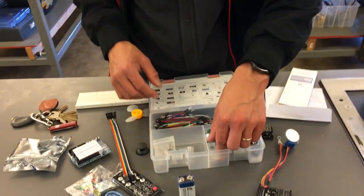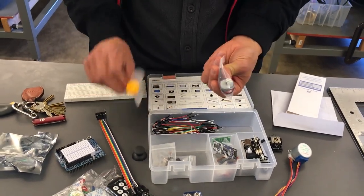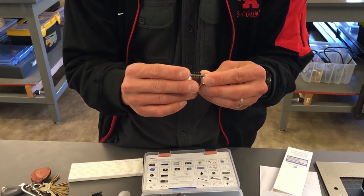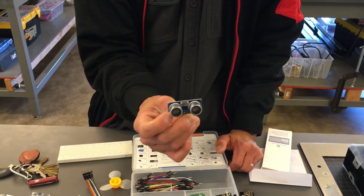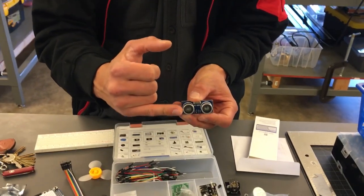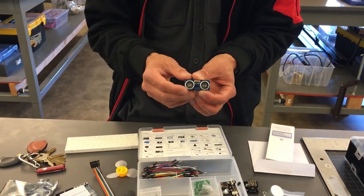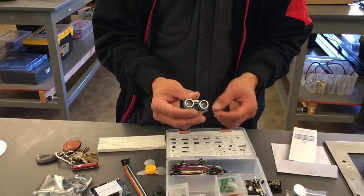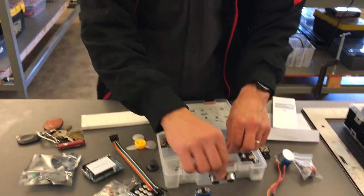A standard DC motor — that's what the little fan blade is for. This is the ultrasonic sensor and receiver. One of these, the T, is a transmitter — it sends out ultrasonic pulses, stuff you can't hear but your dog might. And this is the receiver — it can receive ultrasonic pulses. So this can be used as a proximity detector. I've seen awesome robots made out of these that can sense where they are based on sending a pulse and receiving a pulse, kind of like how bats echolocate.